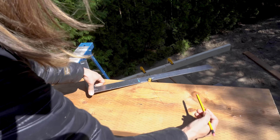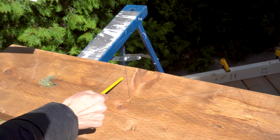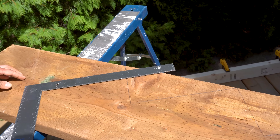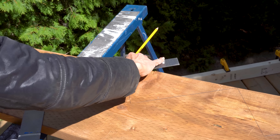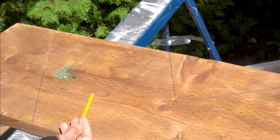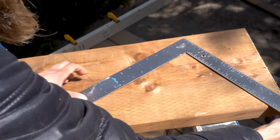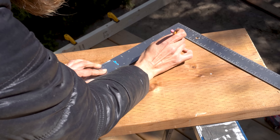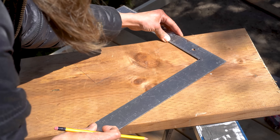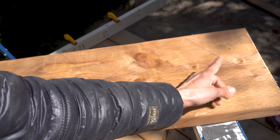So that is our run and that's our rise — that's our tread — and then we can just slide it over, matching up those two points. We have one tread here, another tread, and then one more. Once you get to the end here, you can see we have one, two, three risers. This is going to be the head of our stringer. At this point, we're going to take off the gauges and flip the square to 90 degrees — this is going to be the top of our stringer. Line it up and create a 90 here. Now looking at the base, this is the bottom of our stringer. I'm going to draw in my last riser here, line it up in the corner and flip it. That's the top where our deck is, where the header is, and then that is the bottom. Now we can cut it out.